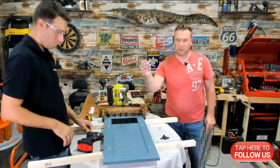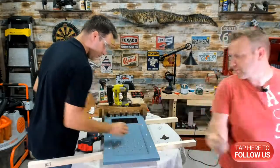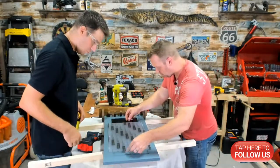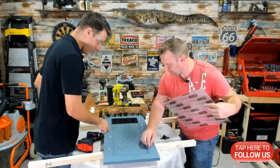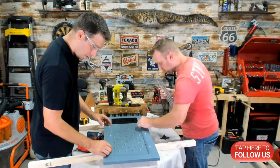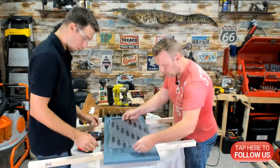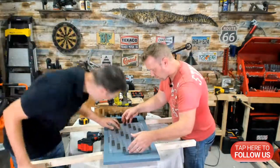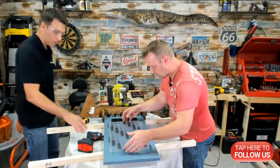We'll just cut an even amount of plastic off each wall plug as a spacer — that should be pretty good. Give me my mark so I can measure where the four corners go. I guess we can line them up with the screws. Probably an even top, maybe bring from the bottom a bit — you want the top one in that line. We'll make our little marks so we can pilot-hole those — you hold it there and I'll drill the pilot holes.